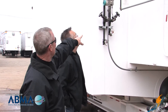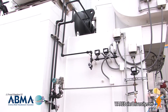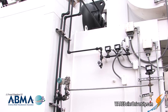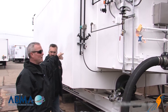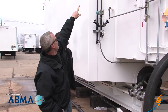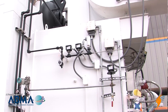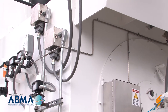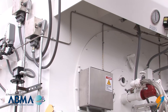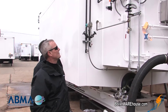Look at the lines up here. Those black pipes coming from the top — that's for the level transmitter. That all has to be heat traced and insulated. It's a dead leg, what we call a dead leg; it has no flow through it. Same thing with the other line coming to these pressure switches — all of that has to be heat traced and insulated. The stainless steel line going across the front is feeding those pressure switches on the front and the pressure gauge. Every bit of that has to be heat traced and insulated all the way up to the controls.